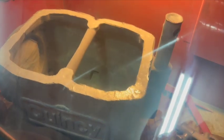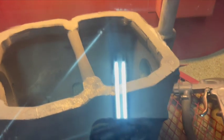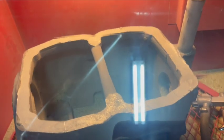Here's what that plastic looks like looking through it — sorry for the glare of the shop light — but it's pretty transparent. You get a good view in there and can see what you're doing a little better, and it protects the glass. It doesn't last as long as the regular film, but it works well enough to get you through a couple of hours and really works in a pinch. This is a little tip I had to figure out this weekend. I looked around at several stores — Home Depot, Harbor Freight, Lowe's, Northern Tool, and a couple others — and I was not able to find that film anywhere locally in stock on a Saturday. So it's something you could do in a pinch to make it so you can do some work.